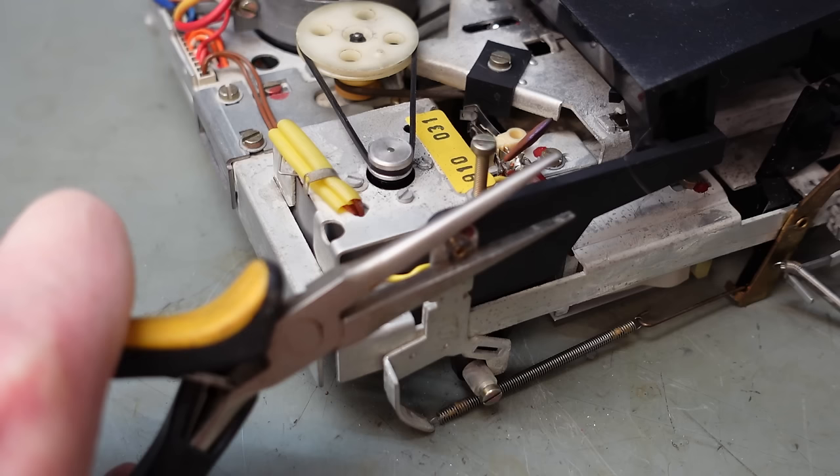It could be associated over here, but we already checked that transistor. It's not faulty. I really don't think it is. But where does this go? Goes to OS3, an external switch, and it switches to negative 11 volts. That definitely could be it. Where is it, though? Because it's not shown on the circuit board. If we follow the circuit through, we find R10 just here, and it goes to this brown wire. And the brown wire goes all the way along this loom, up here, and ends up back at the tape deck. Well, that figures. I've been all over the tape deck several times, so there's a fair chance I've knackered something.